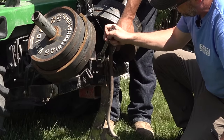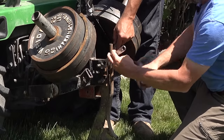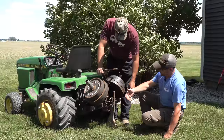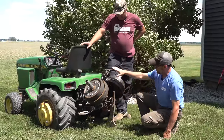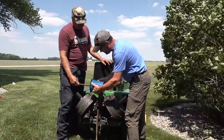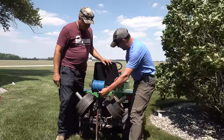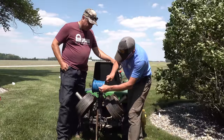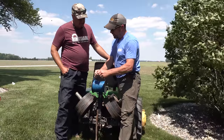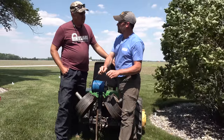The knife attachment was built to match the same mounting holes already in the anhydrous knife. In the kit they send you a really flimsy 20-gauge wire that's not very heavy. I always take the upgrade route and go with this heavier 18-gauge wire. It has a heavier insulation on it and just seems more robust. I've had zero failures with this heavier wire, whereas I've had a lot more failures with the light wire.